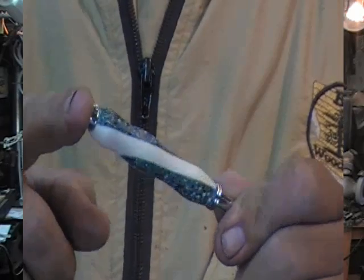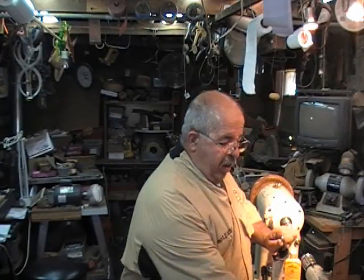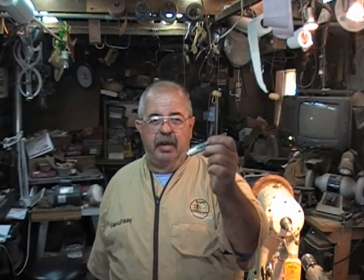Alright, we took scraps. That's right, Corian scraps. A little medium thick super glue, a sheet of sandpaper, a piece of glass, and the regular shop tools. Nothing exotic and nothing special. We turned Corian. I'd like you to play around with Corian a little bit. Get some scraps. Look for a distributor. See if you can get the sink cutouts or the end mill drops and colors that went out, things like that. It's an extremely stable product. It's good for building jigs, rigs, templates. I built the Chuck's Relay Zilla out of it. So it's really good material to work with. I think you'll like it.